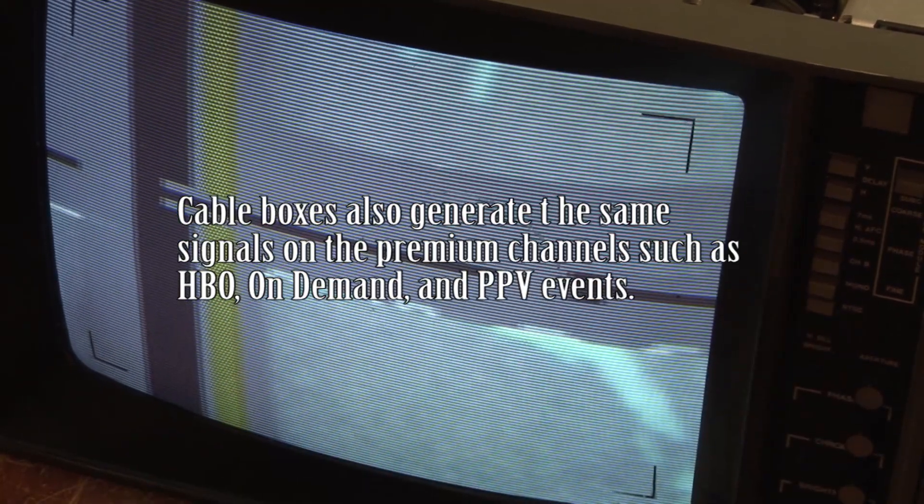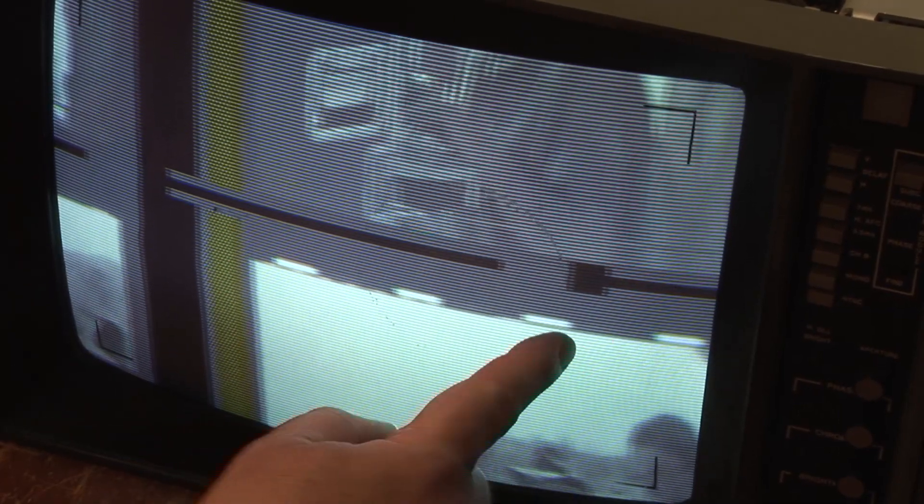These white pulses are much whiter than the brightest white capable of being recorded, and these black pulses are driven right down to the sync level — this is what messes with the automatic gain control on your recording VCR. These two signals over here are the ones that mess with the chips in more modern VCRs; they would ignore the AGC-messing signals and just not go into record at all. They detect that signal and say 'I'm not recording, sorry,' giving you a 'cannot record' message. DVD recorders do the same. The time-base corrector — I'm using the Videonics MX1 — is removing most of the signal, but there are still some keyed signals remaining.